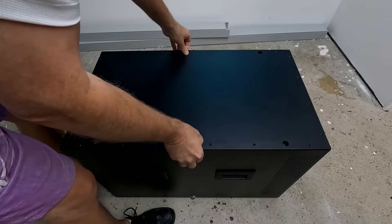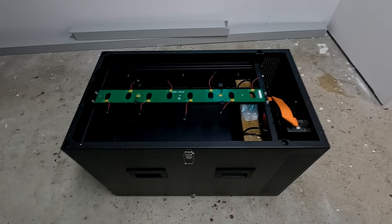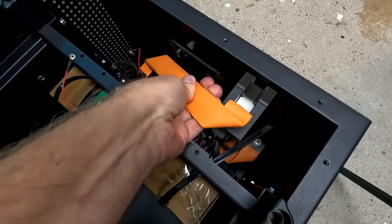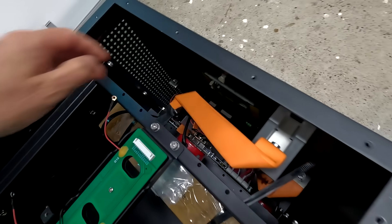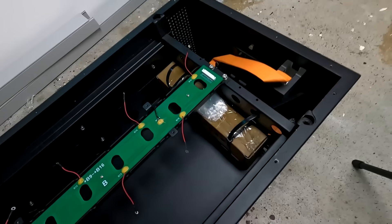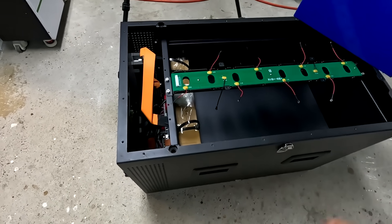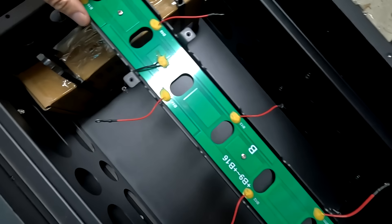I've already removed all the screws from the lid. Oh, that is heavy! That looks a bit different than normally. We've got an accessory pack in here which is secured with cable ties to the compression plate. You can see the much wider and thicker bus bars, protected with electrical tape so they don't scratch the paint. There's one balance cable bus bar at the top and another at the bottom. This is basically a two-layer system - eight MB56 cells go in the top and eight sit underneath at the bottom.